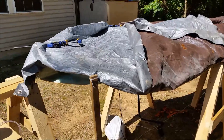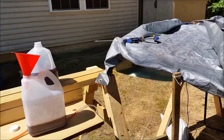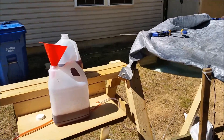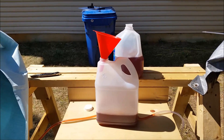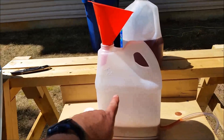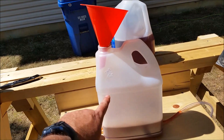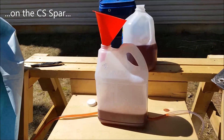One of the things I couldn't get a lot of information on, even though other builders have done it — and I don't think it's too difficult, maybe that's why — is the water level system. I have eight points, basically each corner of the wing, four on each side, that I'll be checking. I'm going to line this jug up so the water level line matches the 17.4 water level line — at least that's my plan.